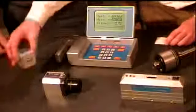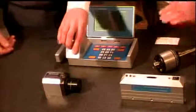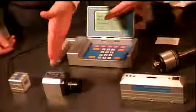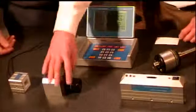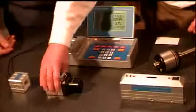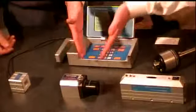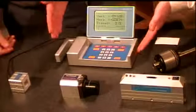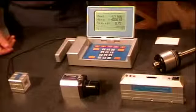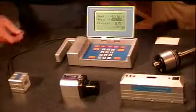So this becomes very handy when you take this receiver and want to check the squareness of machinery. It can be used for checking planar surfaces. And one other advantage is, once you set this up, if you move this 90 line to different locations, you can create a series of parallel lines. So now you can use that for checking assemblies and gantries and slides and rails and anything you want to check to make sure it's parallel.